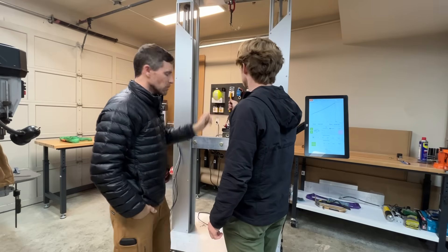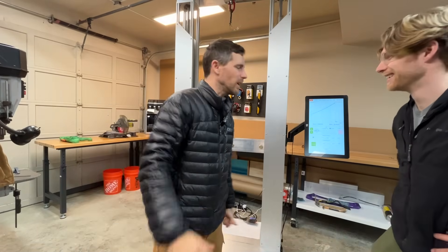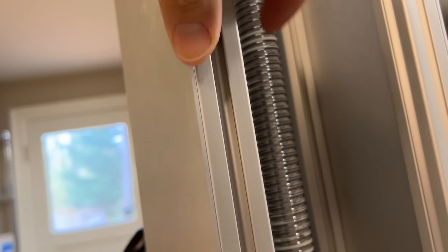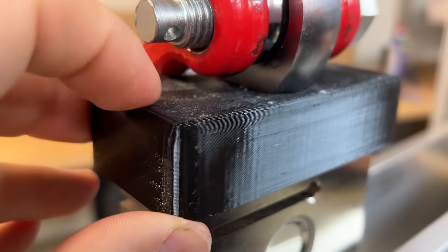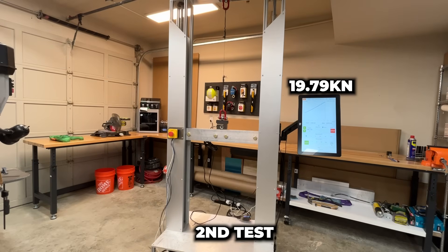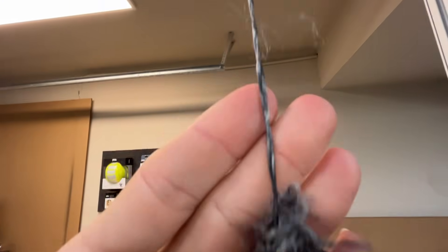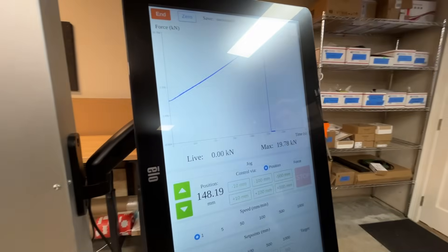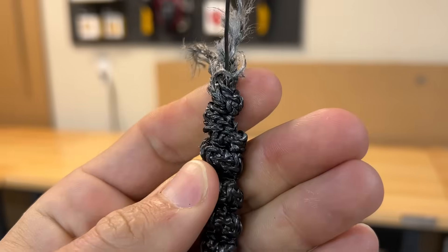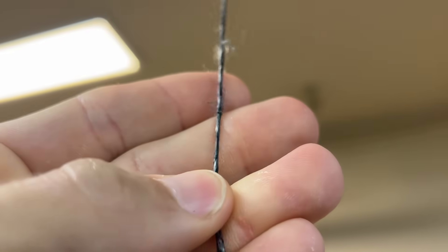There's no heat — things usually get hot when I pull at 1400 millimeters per minute. Wow, that's cold. While we swap to new columns, here's the upgrade: instead of 16-millimeter extrusion these are 25-millimeter aluminum extrusion — about an inch. Chase printed a little top hat so it doesn't clunk around. The header and motor sandwich are the same. Results from the slow pull are very consistent; one sample didn't helix as much — two strands didn't break — but the numbers are close.